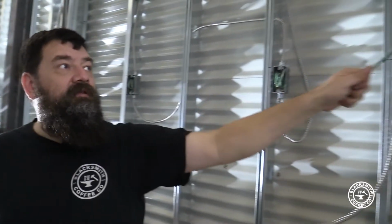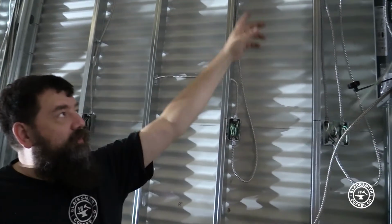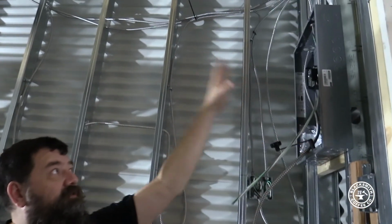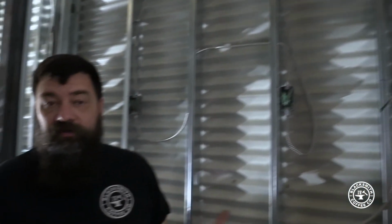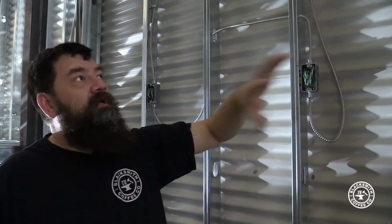Phase 1 of your rough-in would be basically building your circuit. Phase 2 is you bring your home run back to your breaker box. You get your wire in your breaker box and you've completed your circuit. That's it. Now we don't do anything. When we come back later, we'll put our outlets in, we'll put our switches in, we'll do all that.